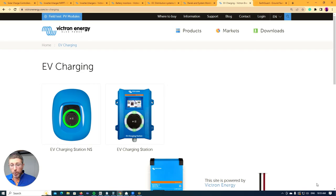The Victron batteries are a really good quality product — they're designed to be put in a caravan or remote home and taken out bush and flogged. But if you're using them in a home or on a boat, you're paying for vibration-resistance you don't really need in a house situation. For us designing systems, we never look at Victron batteries or Victron solar panels for off-grid system design — there are better, more cost-effective solutions available. That's it for all the Victron products I'd highly recommend using in your off-grid design.